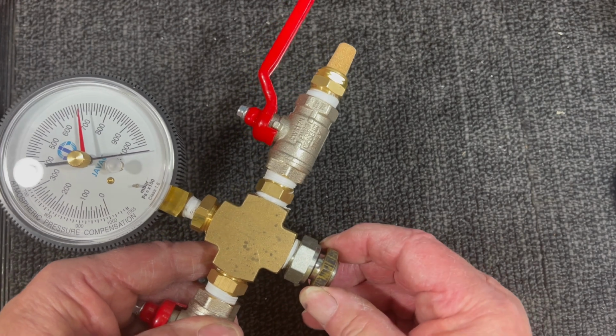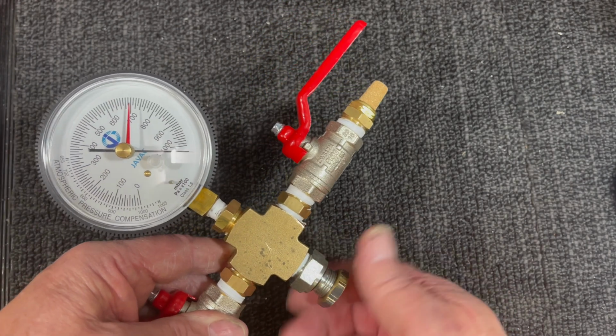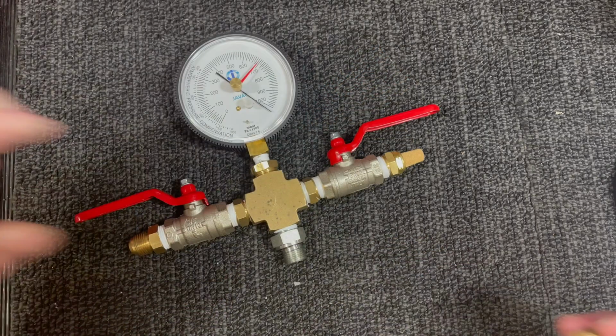The connector must be screwed into the polycarbonate sheet. The thread on the connector is 3/8 BSP and it's a parallel thread, not a taper thread.